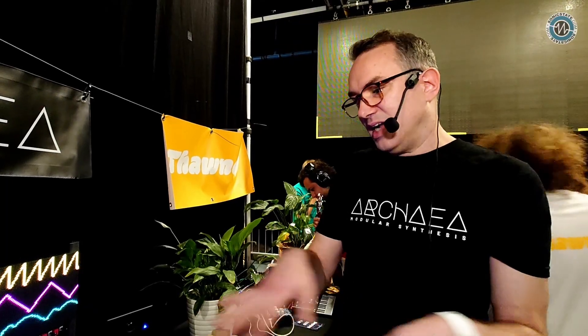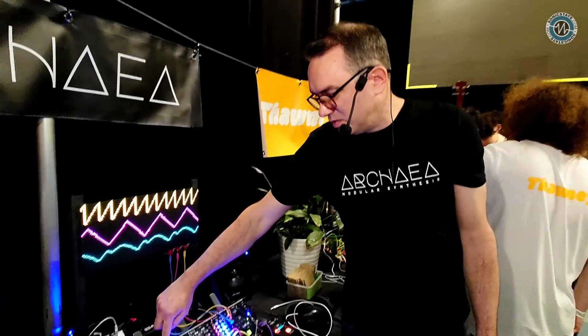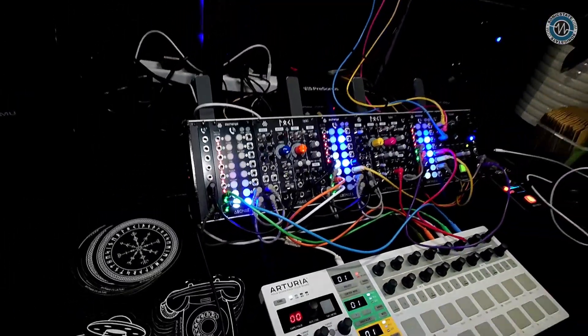So if those lines are unused, great — if you're using them, you can use a dedicated connector. It actually broadcasts MIDI down that bus, which these modules can pick up and decode. I'm hoping in the future to use USB to provide an editor that will allow you to patch things up from your computer. Any MIDI that comes down the USB connector is put onto the bus — so like program change, or you can switch programs with notes. The chain synchronization happens via the modules sending SysEx between each other — it's all standard MIDI, which I'm hoping to open source and give all the details of how that works.